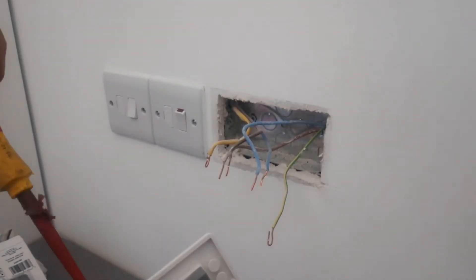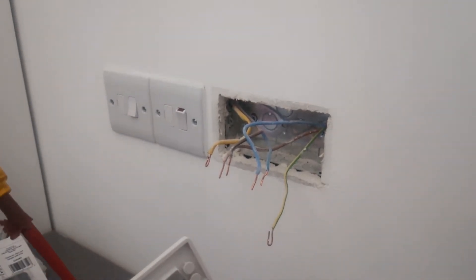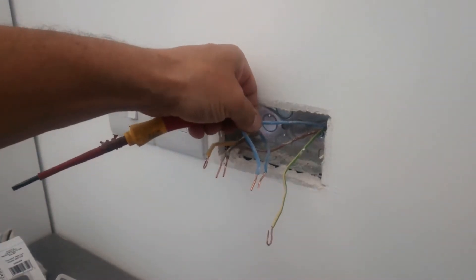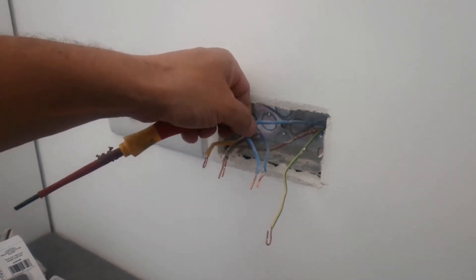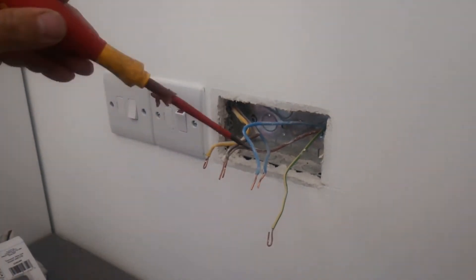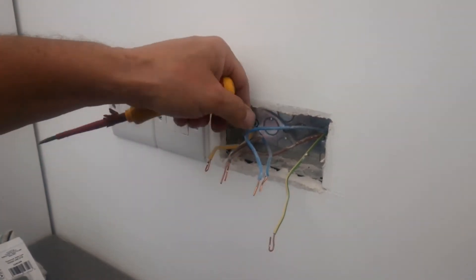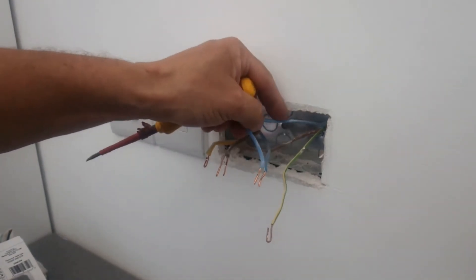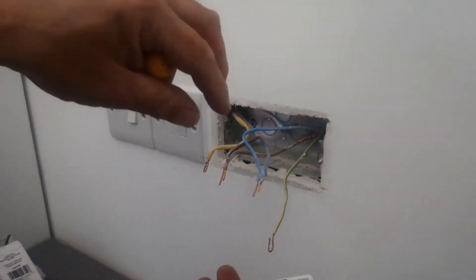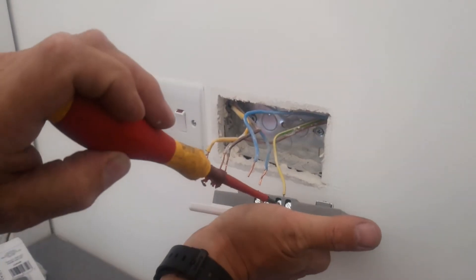The other thing you may find in some houses is the wiring actually inside the socket is not really long enough. If you're not competent to extend these, it might be wise to get an electrician round just to extend the cables out. What they do is trim it back a little bit, put an extension — a bit of 2.5mm cable — in with a crimp, and that will extend it so it will fit the socket. This is a pretty new extension on the wiring, so the cable's quite long here.